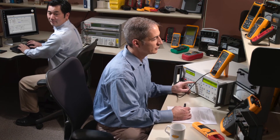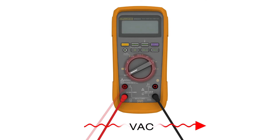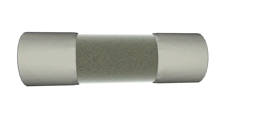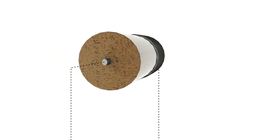Step 8: If you've ever had a blown fuse or mishap with your test instrument, make sure you get it checked out and properly calibrated by a person qualified to do this type of work before using it. Step 9: Never replace a damaged fuse with a fuse not specified by the manufacturer for that specific piece of test equipment. The Fluke meter system — which includes the meter's internal circuitry and fuses and the test probes shipped with the instrument — works together to properly interrupt fault currents that exceed 10,000 amps. These fuses may be the only thing standing between the user and a serious incident. If the test instrument is fused correctly, the only result will be a damaged fuse, which is a small price to pay.